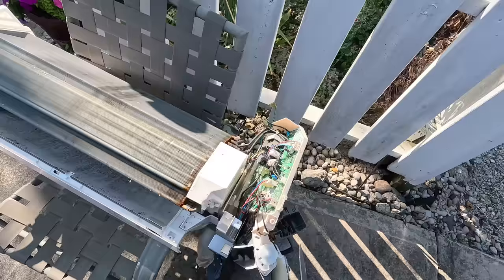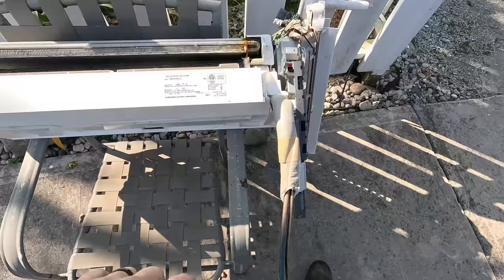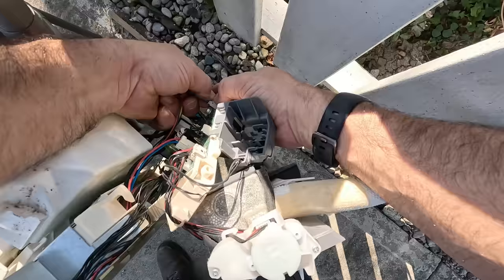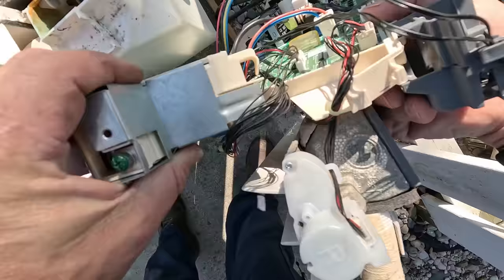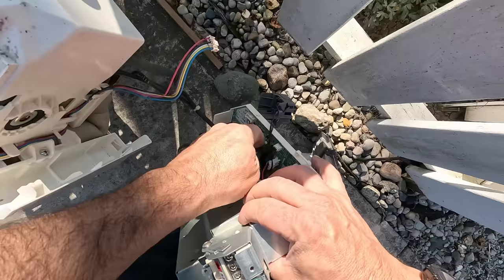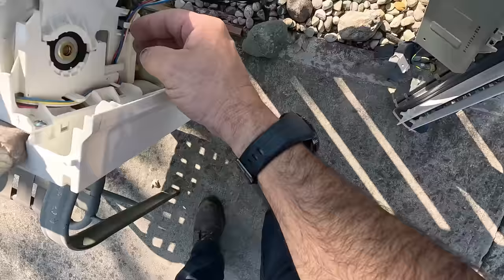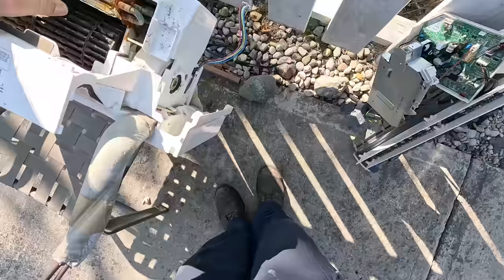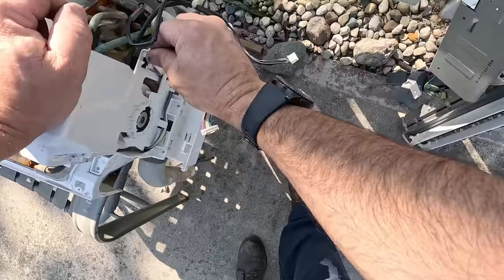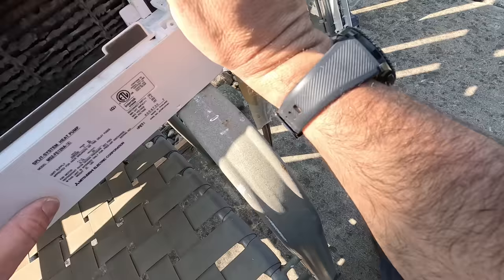You can't break it because that drips the water down into the pan. We found it out there — the test unhooks from right there, and this lifts up. That then releases a lot of that. Here's a plug you'd better undo — that goes to the motor. Loosens all that up. There we go, and then the only thing we've got left is the thermistor there, which we can just unhook for now. Plus I have to unplug the motor. Okay, there's two screws here. Yeah, this is a lot easier than doing it on the wall — I've done it on the wall the last two times. They love their Phillips screwdrivers.